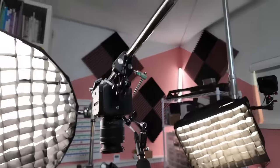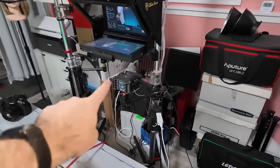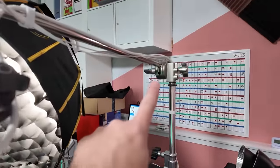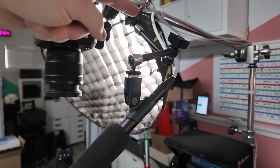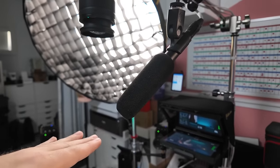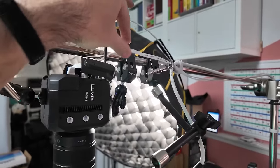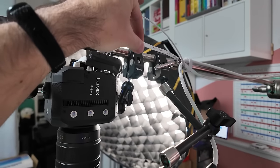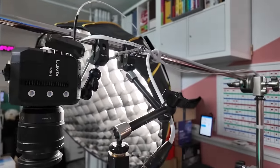It's another BGH1 mounted to this pole. This whole rig I'm really happy with — it's on a single rolling stand with a power strip, an audio interface, a teleprompter with the camera behind it, and a little bracket doing a 90-degree turn with a pole extending out for the overhead shot and microphone. The microphone is on a little arm just above the frame, as close as possible to my face without being in the shot. One of the reasons I love the BGH1 cameras is there are only two wires going to each camera: an Ethernet wire and an SDI cable. Ethernet carries network control as well as power, and the video signal goes over SDI. I bought special flat Ethernet cables and super-thin SDI cables, which makes it a lot less bulky.